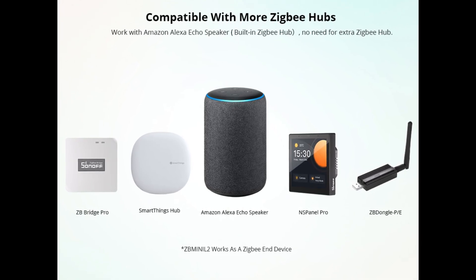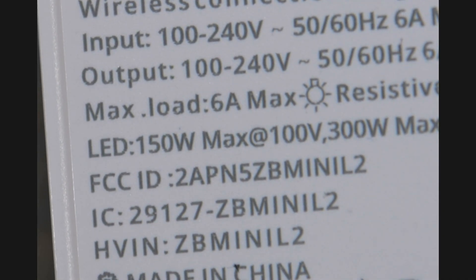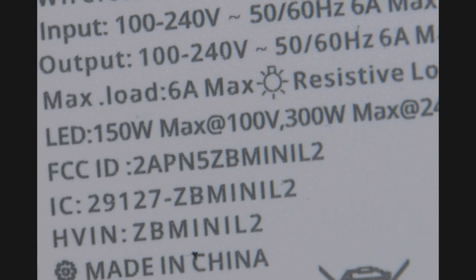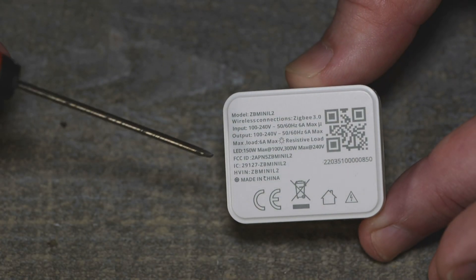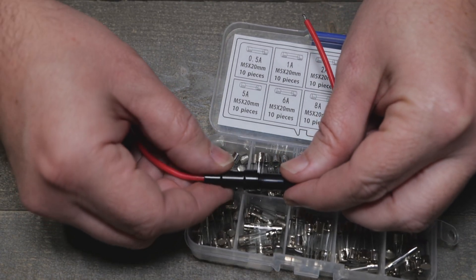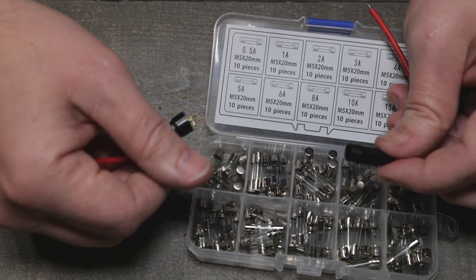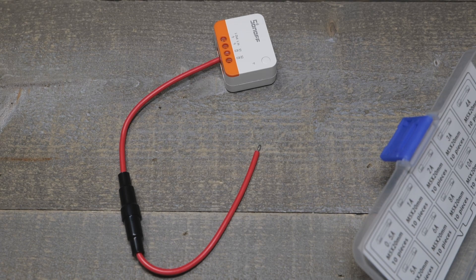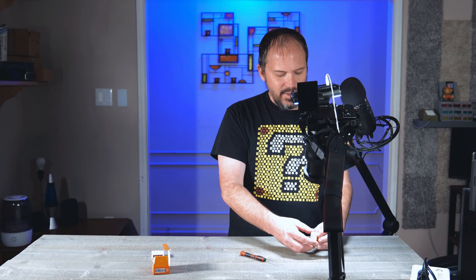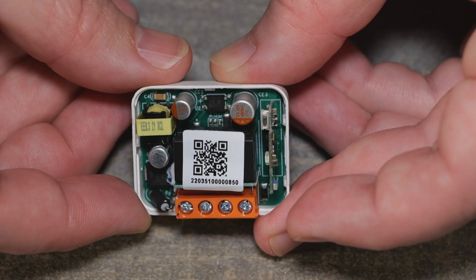You can see that max load already — six amps. So I highly recommend: I'm going to open this thing up, and if there isn't an inline fuse inside it, I would bring your own little fuse to put in line with this, just in case of some type of short or overload. You never want this switch to be the weakest link.